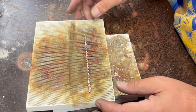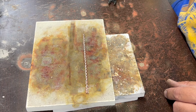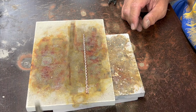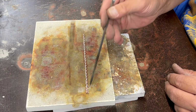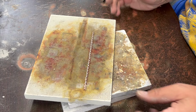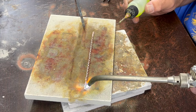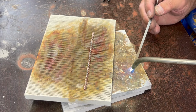If you haven't been to my channel before, I use primarily hard silver sheet solder. And I use a liquid flux. This particular stuff is My-T-Flux. My torch is a Silversmith model, which is the acetylene torch. And it's a great torch, I love it. I use a number one tip. So I'm just going to use my pick and pick up a little bit of solder after I flux the ends and get it to be kind of connected together there. I don't want solder to run the entire length, I just want a little bit to hold it together.